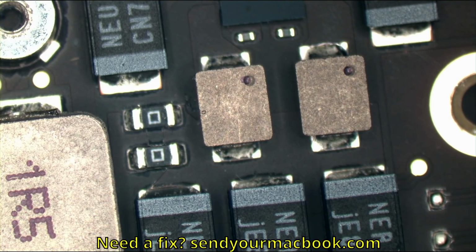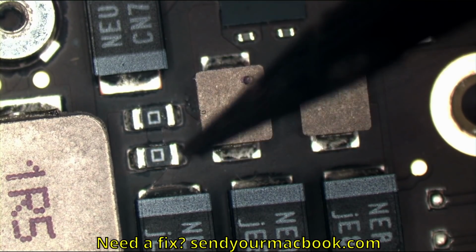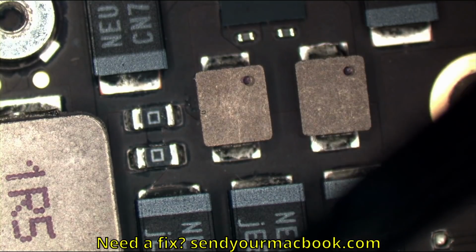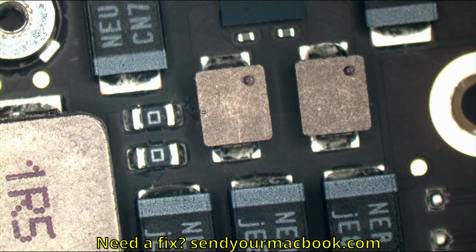So that could be the case. You really can't know. So that is for PP3V3_G3H_RTC. But again, it's not going to be anything around this area that has a problem, because as we went over previously, the issue was with PP_BUS_G3H not being present, not with this. So there's really no reason to blame this. So we're just going to continue going.